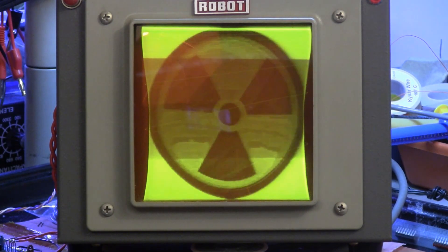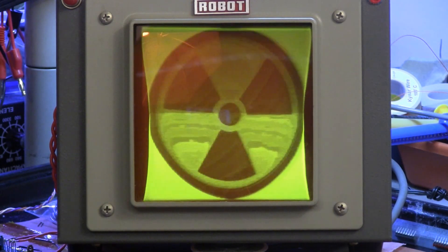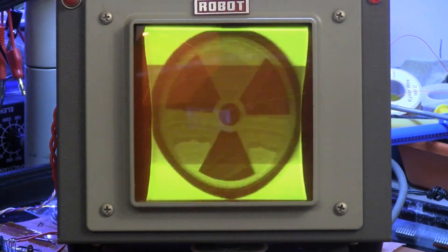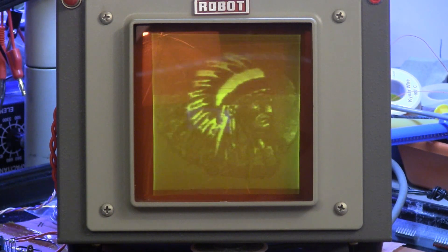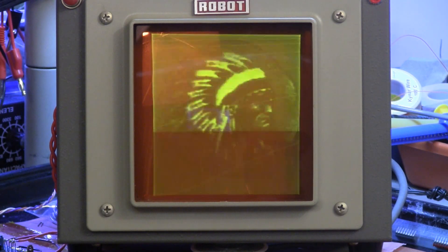So I replaced the chicken with the dollar sign. The radiation trefoil looks better, but is still showing contouring, so I suspect I either have an open bit in my data path or shorted bits — I do not know. This picture does not look like this on the computer. There is the Indian chief image from the lithophane on the front of my test pattern generator project — still a bit dark, but we can see a lot more of it now. And that is all eight images stored in the memory.